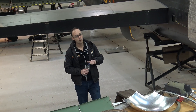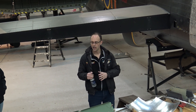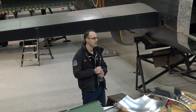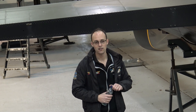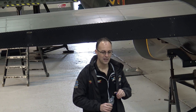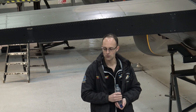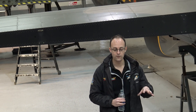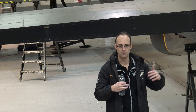At the moment the port wingtip is much further on than the starboard. Because of the quantity of material we've had to reproduce, we asked the supplier to concentrate on one wingtip first. We've had all the port ribs, stringers, and everything come back, so that's going through paint now to be built back up. The starboard one — we're waiting for about a third of the items still to come back. The chap's gone on holiday, which isn't helping at all, but when he returns we can finish that part. We'll do a circular route to collect everything, fit it all back in the jig, get it painted, and start riveting. I'd expect in about a fortnight we'll see the port wingtip being riveted together, and then the skins will be fitted, trimmed, and built up as well.